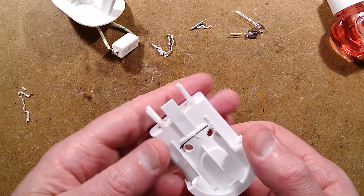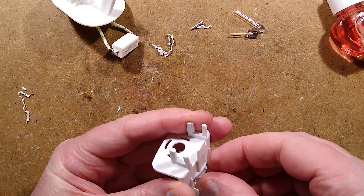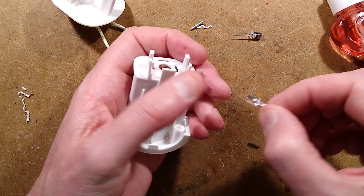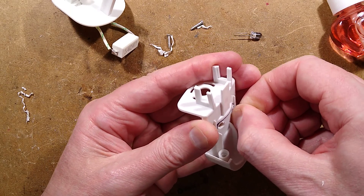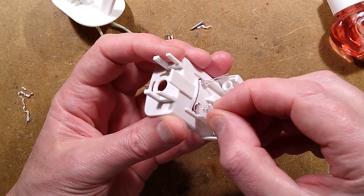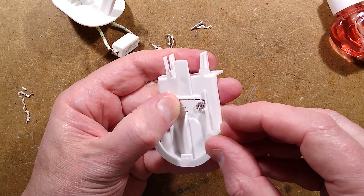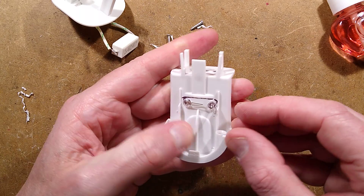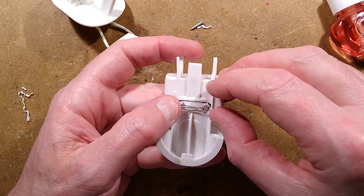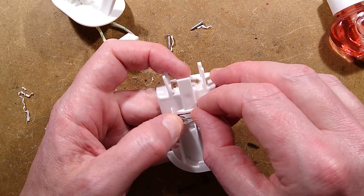The holes have been drilled. Let's get some rags of plastic off and stuff the LEDs in - one will be going with the positive up to the top and the other one will be going with the positive down to the bottom. That's a long lead. They are a nice friction fit. Now I'm going to fold those leads across and solder them to each other. Wow, that's so easy - it's actually working quite well. I shouldn't say that in case it all goes horribly wrong.